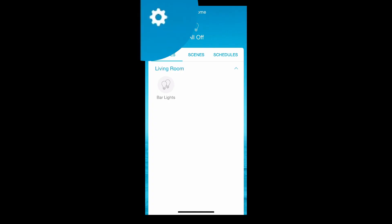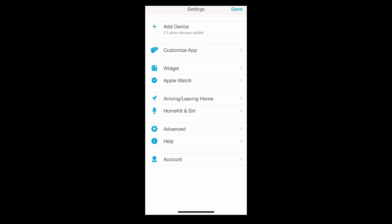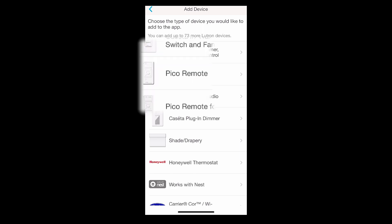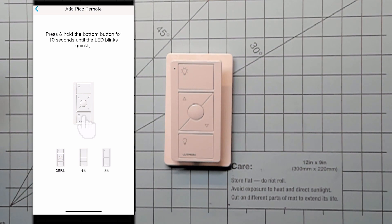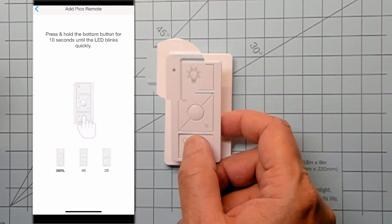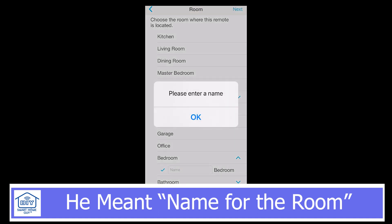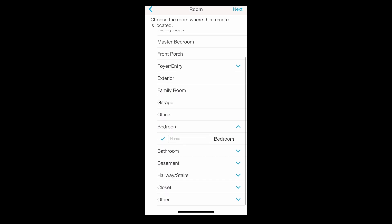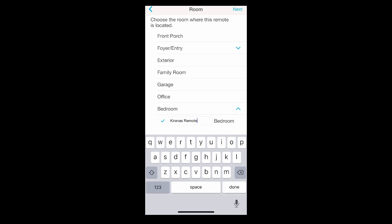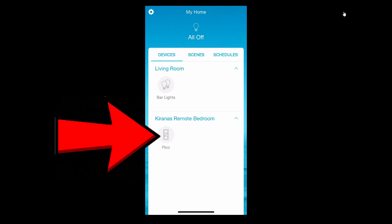Once you're inside the app, tap on the gear icon to open up the main menu. At the top, you should see Add Device. You should have an indication that there is already one device installed, and that device would be the Smart Bridge. Then click the plus symbol and wait a few seconds. Pick the device type — which for me was the Pico remote. You'll want to follow the manufacturer's instructions for how to pair the device. In the case of the Pico remote, it is holding down on the bottom button for 10 seconds until the little light flashes rapidly. Select the room you'll be putting it into and then enter a name for the device — if you don't, it's going to complain. Trust me, it will complain.